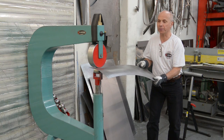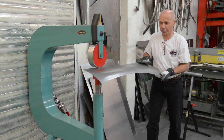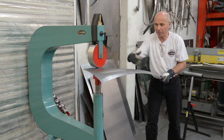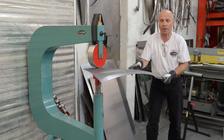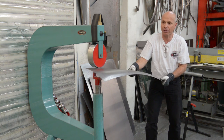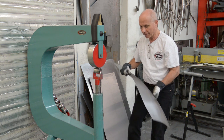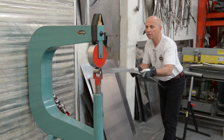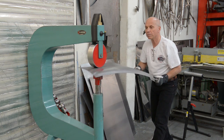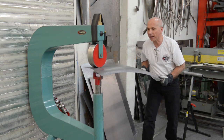Now I'm back at the English wheel and you can see we have a curve on this part here but we don't have a curve on the top part. So what I'm going to do is wheel about two thirds from this end and blend it in. Look at the shape when I'm wheeling this so I can get rid of all this stuff and make a nice shape to the whole thing — I take it little by little. When I listen to the sound I think I can go with a little more pressure there.